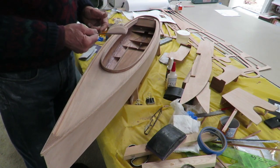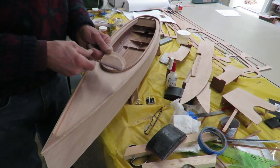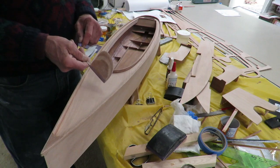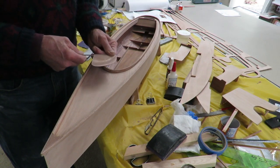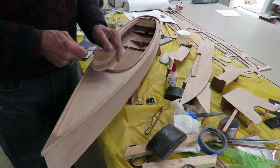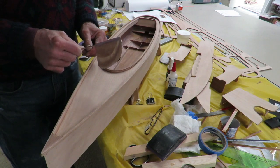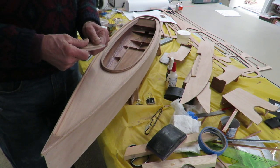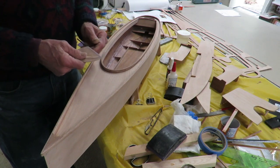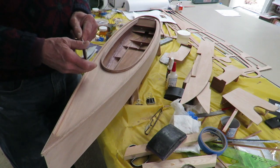And you may remember that we had clear coated our rudder. If you haven't, just go ahead and clear coat it with a thin layer of clear epoxy on both sides. We rinsed that off because when you clear coat, often you get an amine blush, which rises to the surface of the epoxy and will keep other things from sticking to it. You can use acetone, but you can also use warm water. It works just as well. It's water soluble.